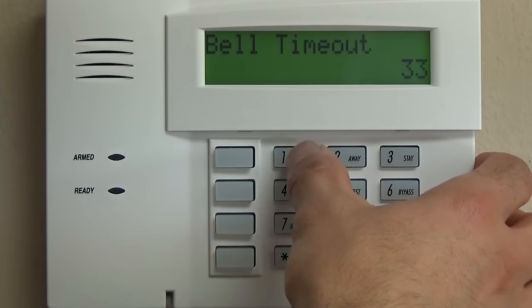Okay guys, and now here we are back, starting at field 59, continuing our Vista 20P programming, and we're going to continue here and pick up where we left off on the last video. Star 59 is your exit error report. Typically we were going to input a 0 for that guy there.